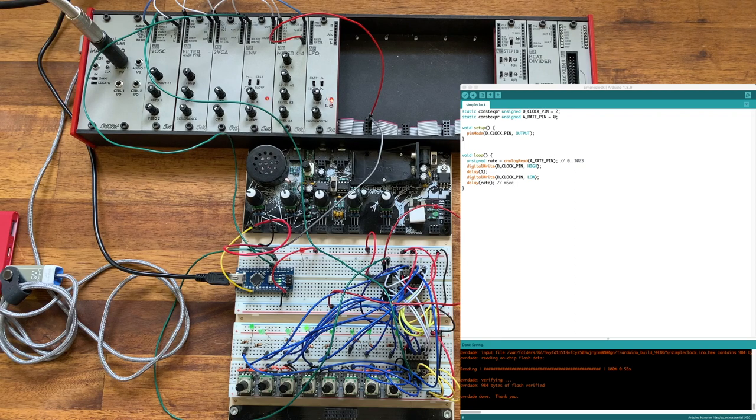And then all I've done is changed here a line where I read that analog pin, which will return between 0 and 1023, and use that to change the delay in between each loop cycle. As this delay is in milliseconds, that's going to mean that it's between potentially 0 milliseconds and about a second. So far, the Nano really hasn't given us anything extra. It's just working in the same way as our original oscillator.